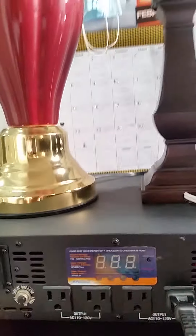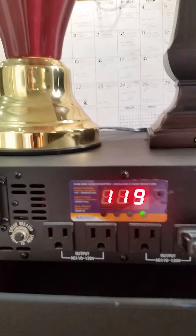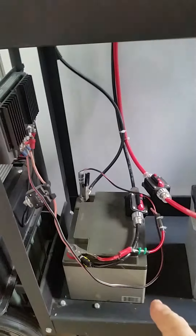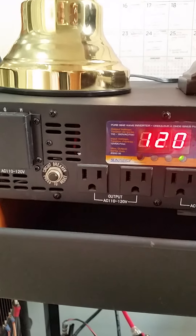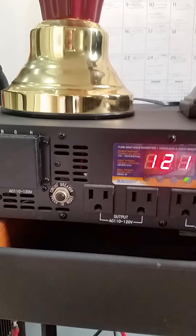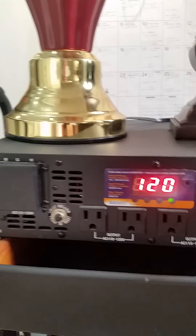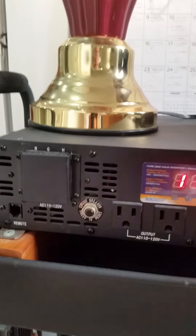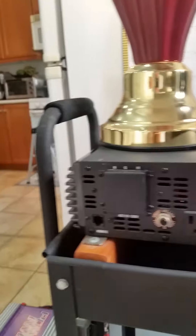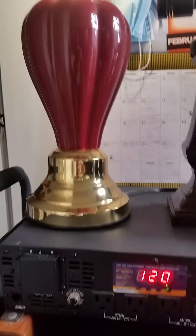I think for the meantime we now have alternating current. I will switch on this first inverter here. It's alive — because the solar battery has more than enough charge to power up this inverter. An inverter is a machine that converts direct current to alternating current. The output of this inverter is now alternating current — 120 volts. We are here in the USA, the voltage is 120 volts. I plug in a lamp and it's lit right now. We are powering up the lamp using this inverter.